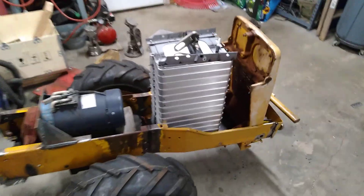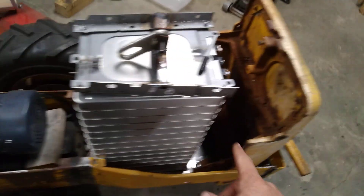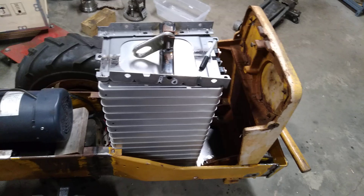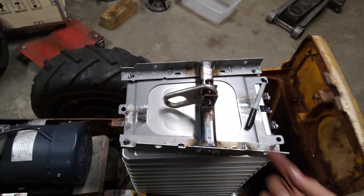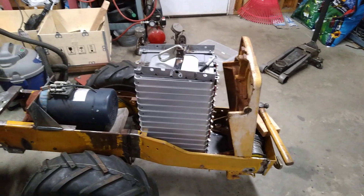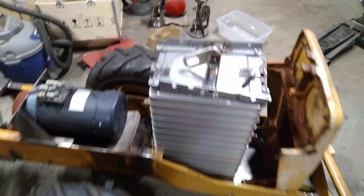The other thing I did — I had the battery out last time. What happens is there are these little screws on the bottom, and there's all-thread that goes all the way through this battery pack, all the way down through the eighth-inch steel floor, all the way through that, and bolts from the bottom. So it's pulling it down tight into the chassis — sucker solid, really cool. Then all I did was make this little lifting mechanism. You take those four nuts off the bottom of the battery and put them right here, and then you lift this thing out. It works really well. It's not something I'd like to do very often because it's kind of a pain to get back in there, but it was a good idea and it did work.